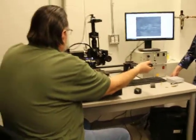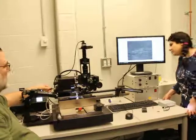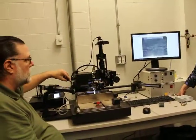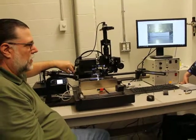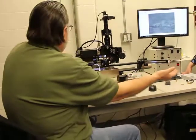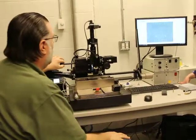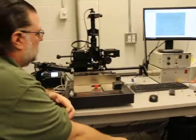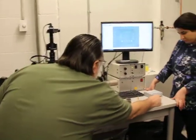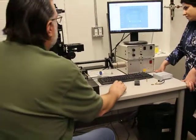Whenever we bring this arm down, we always want to make sure that this arm is in the up position, and we always use this arm to finish placing. This gives us nice precision, accurately coming down in place. Once we bring that all the way up, then we bring this and finish, and then we bring our optic tower back to where it was. As for the placement head, we won't get into that.